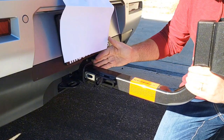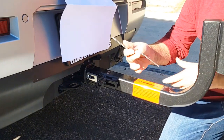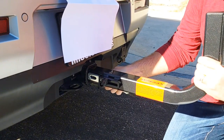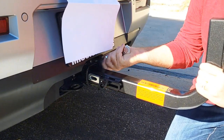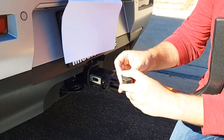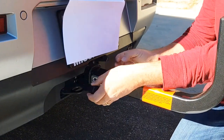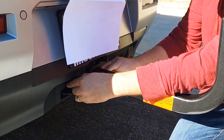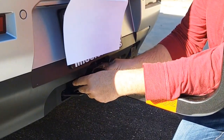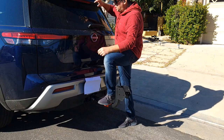The pin goes in from the right-hand side, and once you tighten it with your hand, you use this torque tool - it's up to 68 newton meters, as it says - to tighten it up. Once you tighten this up, you have a lock which goes over here. The key is inserted when you need to unlock to remove it, but it locks automatically when you push it in. When you need to open it, you just slide it down.